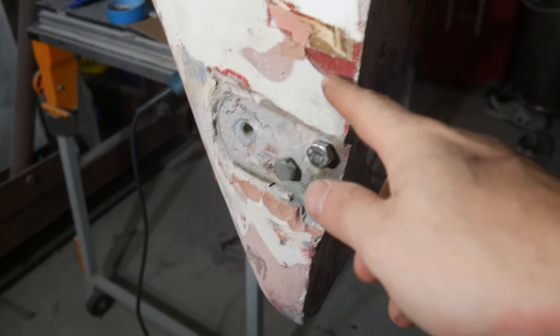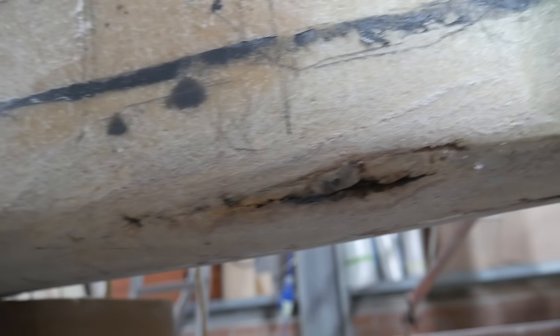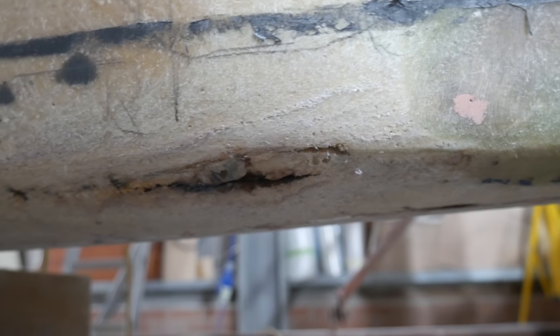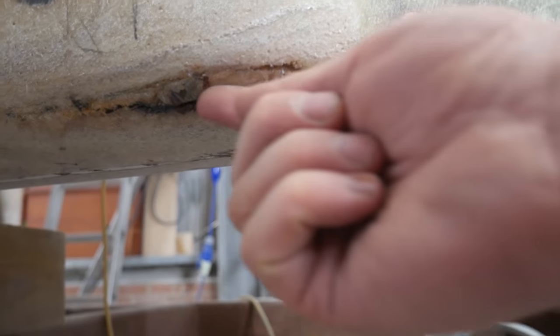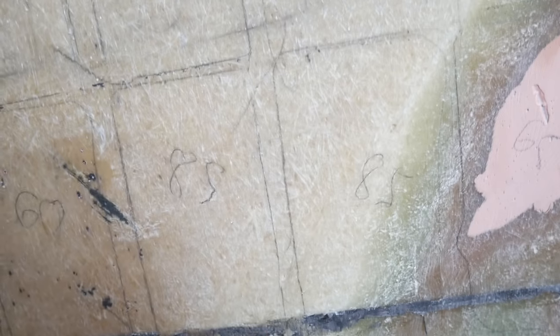I also need to do some work on the rudder on the skeg. This is all just filler, and it looks like it's filler over anti-fouling. I think it's a bodgy repair from when she hit the reef and the bottom got knocked off, so I need to get rid of all that filler and relaminate the skeg. That housing has come off - I'll talk more about that later. Now you may remember me saying a few weeks back that I had a hole in my boat that I needed to fix - that's basically this crack along here, which is about 70mm by about 5mm wide, just underneath the keel right at the back.